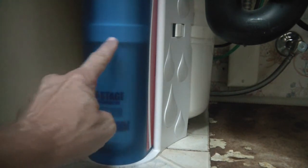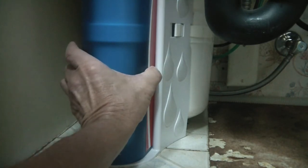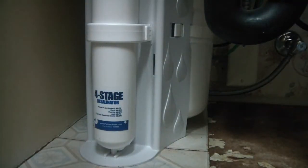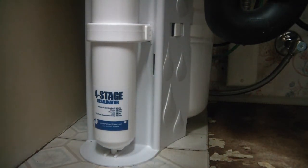You can see this little ridge here — that's a little clamp that holds the filter to the body. Just below that, put your hands on both sides, squeeze, and pull out. You have little tabs that fit in right there, just below that, and that removes the cover so we can get to the four-stage filter. Also, once I turn the supply valve off on top, I open the line to the reverse osmosis spigot on top to make sure all pressure is released.